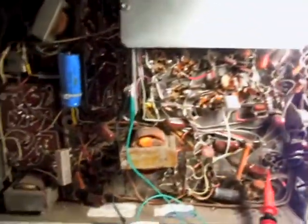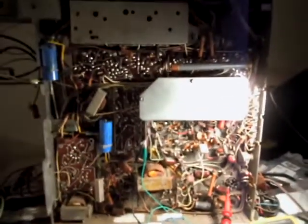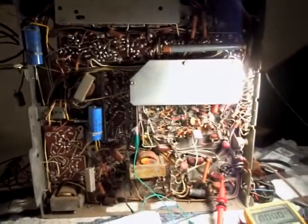I've got my CTC11 chassis all prepped up, with new caps carefully placed in there for different voltages — like the doubler and the sweep and what have you. I'm just going to do a soft start, check some waveforms, and make sure that it's ready to power up.